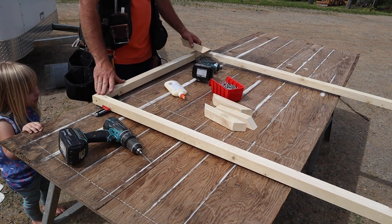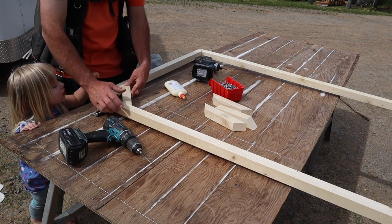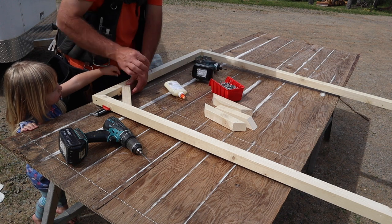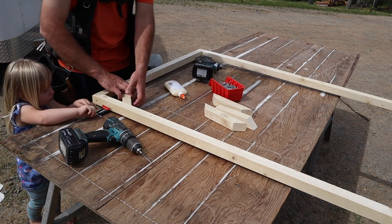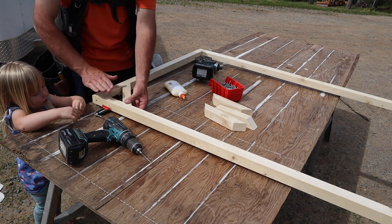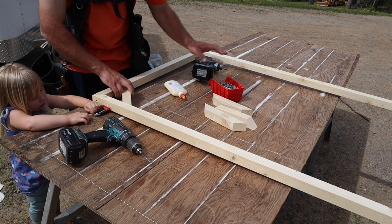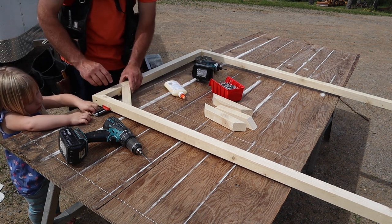Being as this is a two-by door, I do want to make sure that it is braced really well, so we're going to go a little crazy on the bracing. I'm adding these 45s here, and then we'll also add some plywood on the top side at least. On the face here we'll add some more, but we'll get there when we get there.